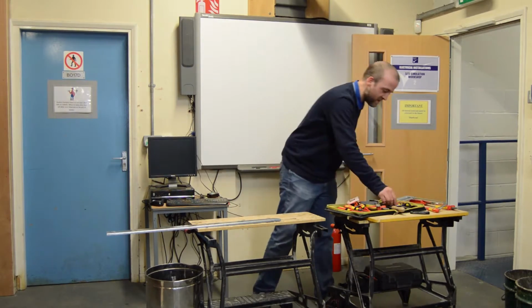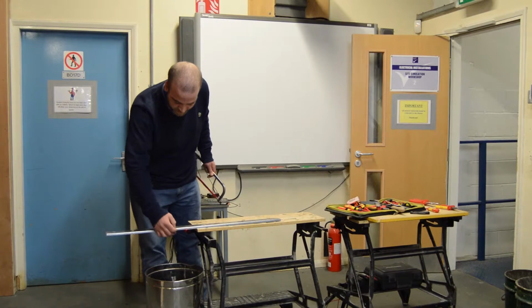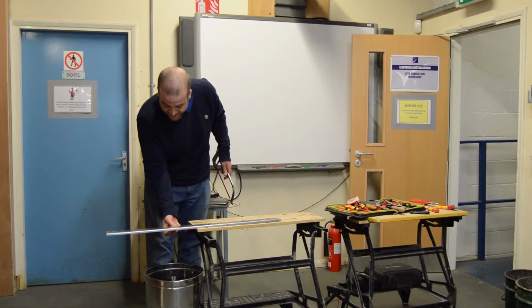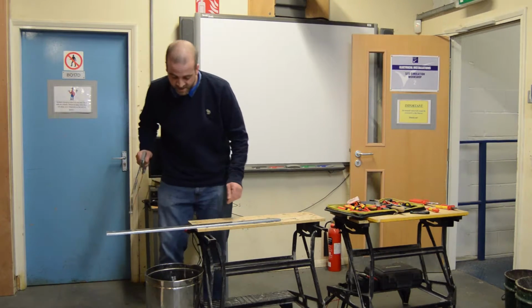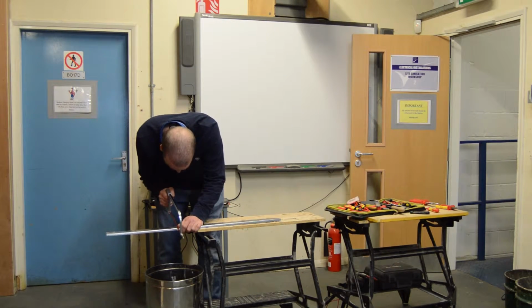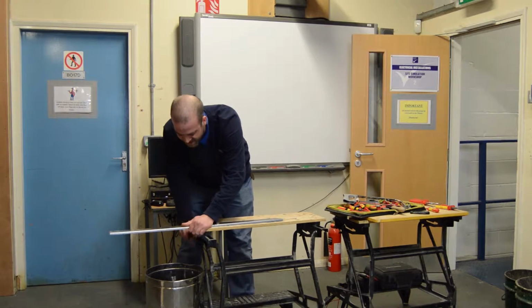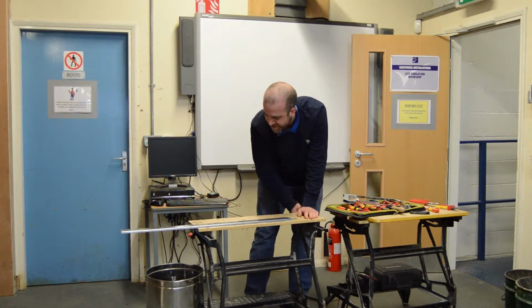The two outside lines rather, we're going to cut down all the way from one lip down to the other lip, but leaving it on. I will demonstrate what I mean by this when we get a bit closer. So first things first, we're going to cut using our hacksaw. We cut on the line as well. Try and make sure the tray is nice and secure, because it will make our cutting easier and straighter.